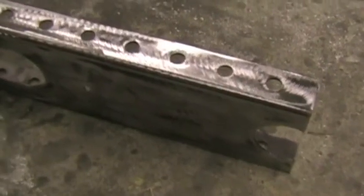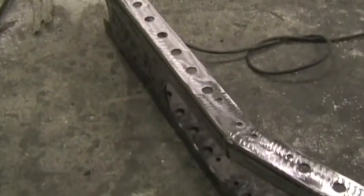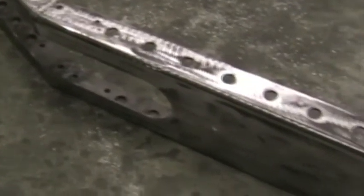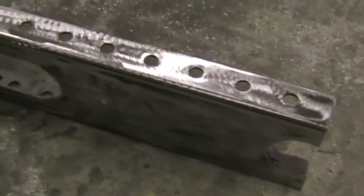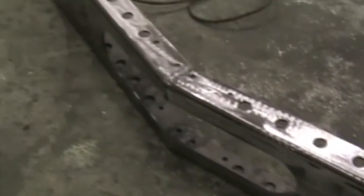And on this side, I'm going to bond in the carry through spar now whilst the other resin has not yet set. It'll save some sanding. Ideally this should be sandblasted. In this case I've chosen to grind it with a grinder, but make sure it's absolutely free of scale and roughened. And I've now mixed up cotton flock and I'm going to bond this in.